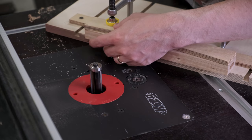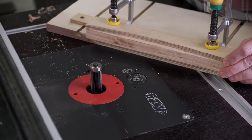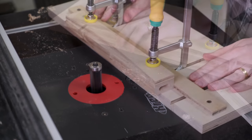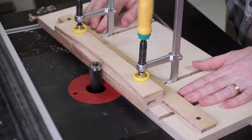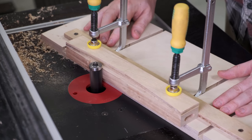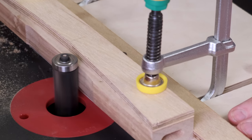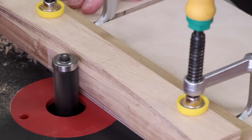The apron and template are clamped onto a jig — basically a mini version of the tapering jig from the other week without the mitre runner. The flush trim bit bearing rides up against the arc template, very quickly removing material. This type of jig is much quicker than using double-sided tape.